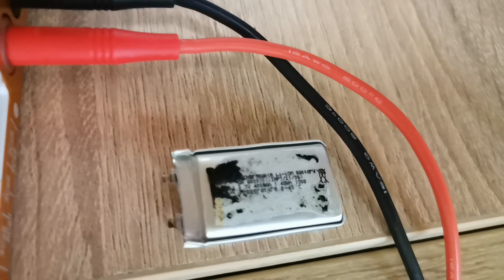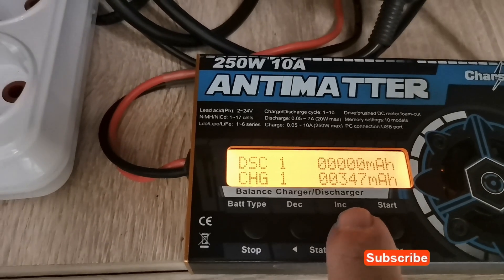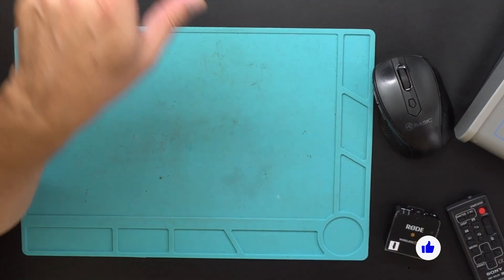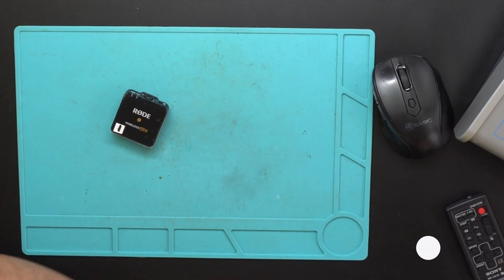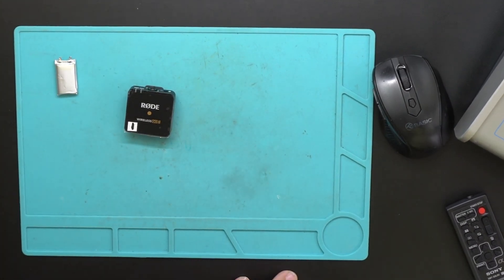I have a replacement battery that says 400 milliamps, but after a series of charging and discharging cycles I measured it at around 300–347 milliamps. The original is around 350 milliamps, so that little battery should fit and do the purpose.